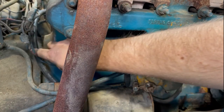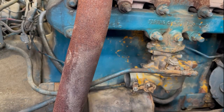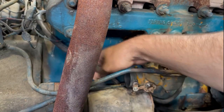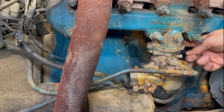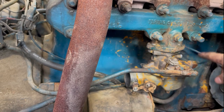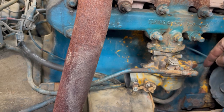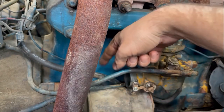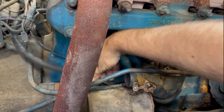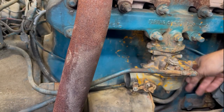And the gas hose loops around here. I found that the best routing, the original hose kind of came up here like this. It was rigid and it came along the back. And then this nipple over here was at 90 degrees and it was facing right towards the block. So now I angled it downwards and then that allowed me to bring the hose down behind the starter over here. And then back up from the back and we'll connect it in over here.